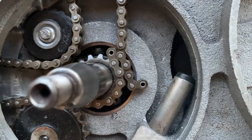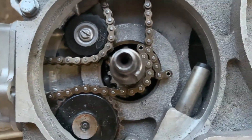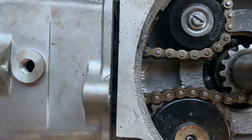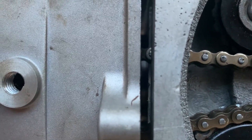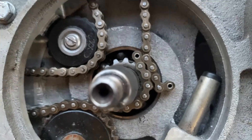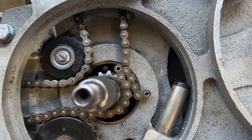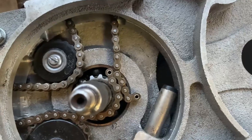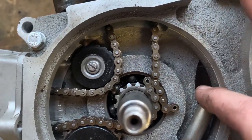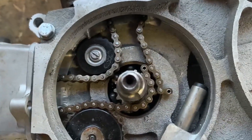I can't actually shorten that so I can get this cylinder flush, because that's a 110cc crankshaft - the crank wheels are actually slightly larger and they're interfering with the cylinder skirt that protrudes from the bottom. So we're looking like we're going to need to cut the chain by about one, two, three, four links, then I've got a link to rivet in, and from there we'll come up with a little tensioner and she'll be all right.